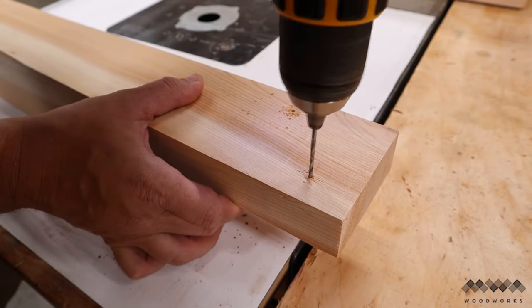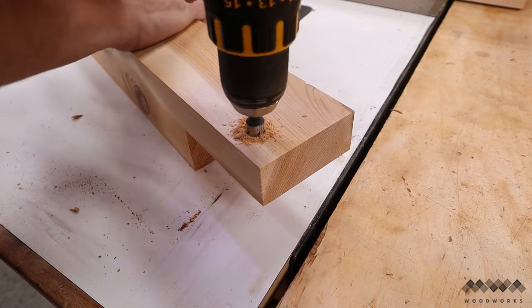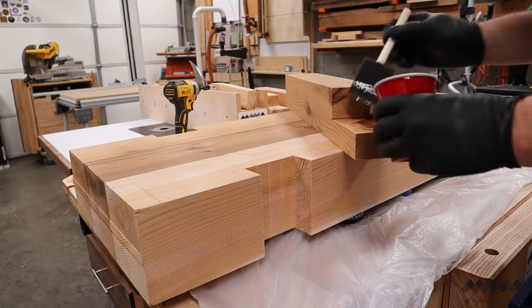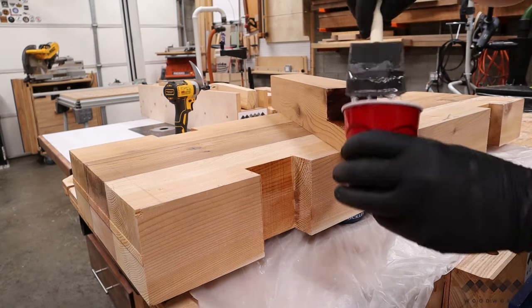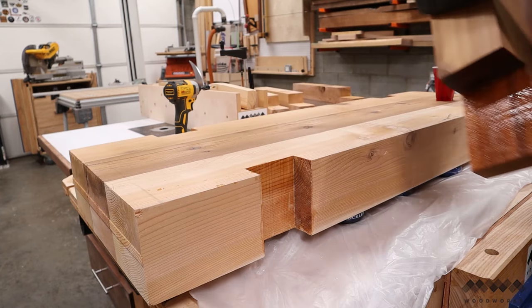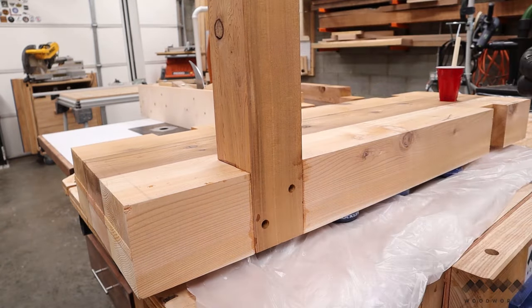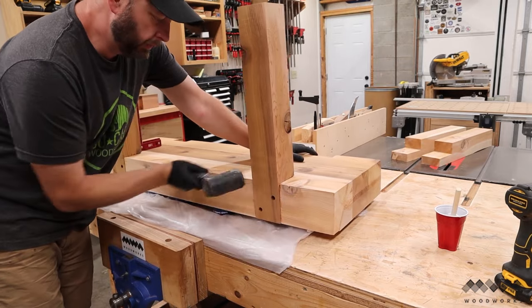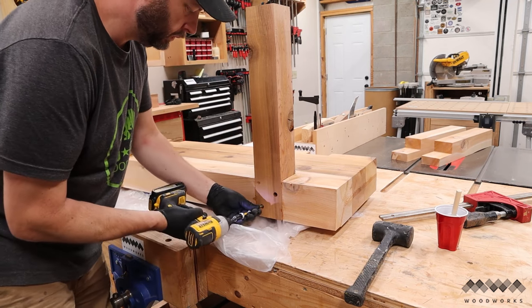Even though I plan on using epoxy on these legs, I thought it might be a good idea to reinforce them with screws. At the very least, the screws can act as clamps while the epoxy cures, so I don't need to fool around with those. Once I have my pilot holes cut, I add plenty of epoxy to the joints — it's important to apply enough epoxy to the end grain as it really soaks this stuff up at first. I want to make sure I get a solid connection and don't starve the joint of epoxy. The leg just slides in nicely thanks to the epoxy being pretty slippery, and then I added a couple of 3-inch screws to tighten everything up. On one leg, even the epoxy wasn't helping it slide in easily, so I applied a little persuasion with a rubber dead blow mallet, since cedar is pretty soft and I didn't want to dent the face of the leg. It's also a good idea to double check everything for square before moving on.